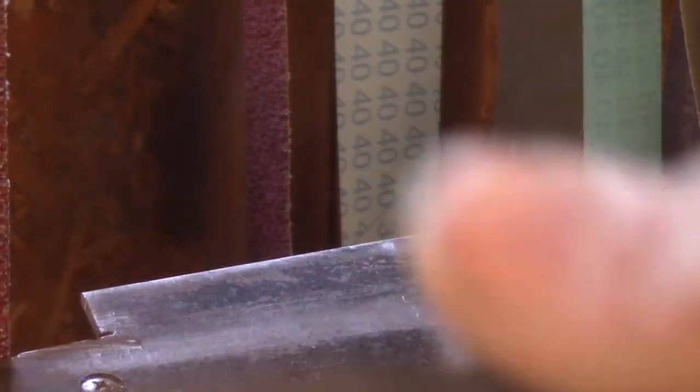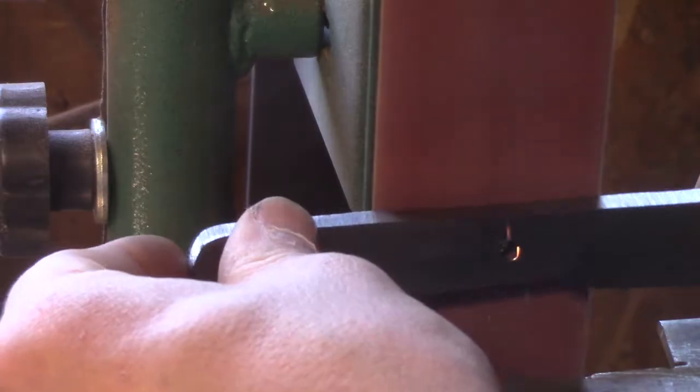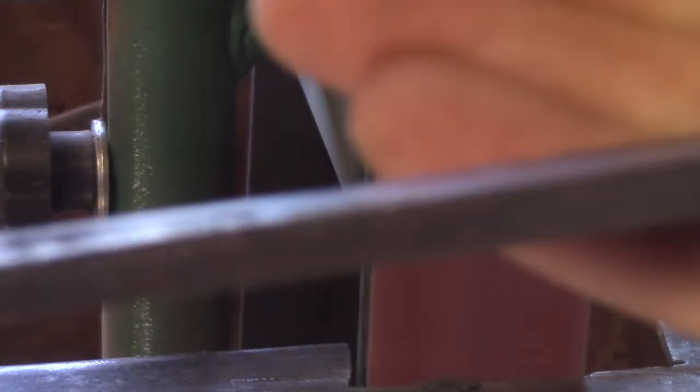And also run into some snakes. So I ground this knife flat and drilled the holes. You can see there's this little piece sticking up, so I'm gonna hurry and grind that flat. I don't want to have anything sticking up at all because then the handles just won't go on straight — there'll be a little bit of a gap.